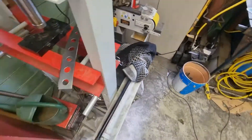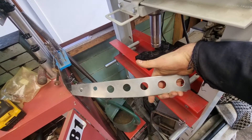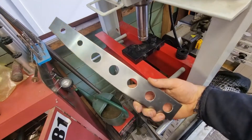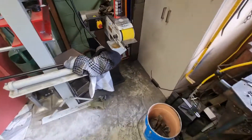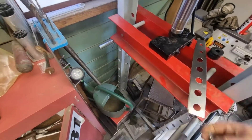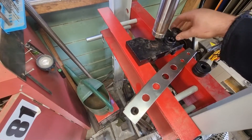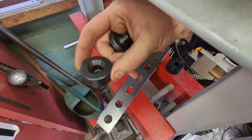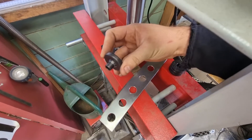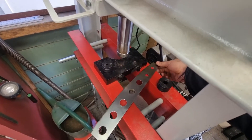This is out of 1.6 cold roll. Here's another one I've made for the other side - I've used pretty much the same template. I've got a chassis punch that I use, which is a hydraulic punch - look them up, very simple. It punches the holes through, creating punched-out circles. You drill a hole first and then punch a nice wafer out. I'll dimple these and show you how it all works - again very simple. You have a die that it pushes into, slide it in there, push it together with the hydraulic press.